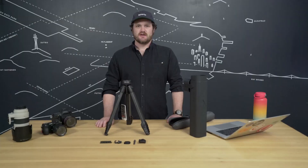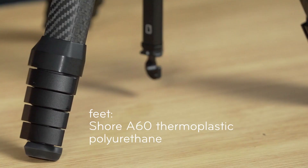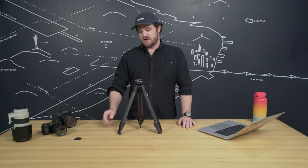Let's walk you through all of the different parts. Starting at the very bottom, we've got our rubberized grippy non-slip feet. Something cool we found during the design phase is that the feet of a tripod do a lot of the work in damping vibration, so we tried a bunch of different materials. This is Shore A60 Thermoplastic Polyurethane. Right above that, we've got our low-profile cam levers. These levers are tuned specifically to be easy to open, but designed so that you don't accidentally deploy them.